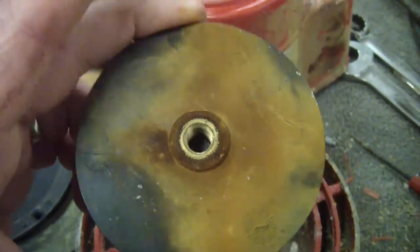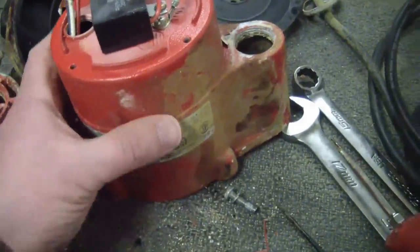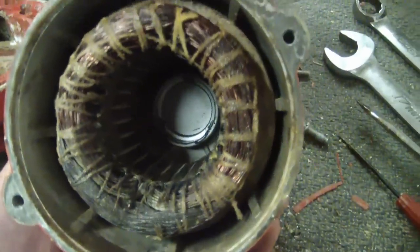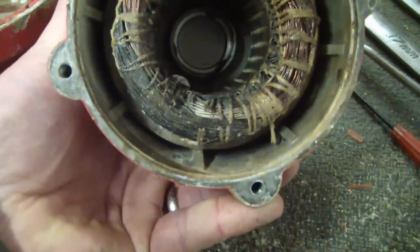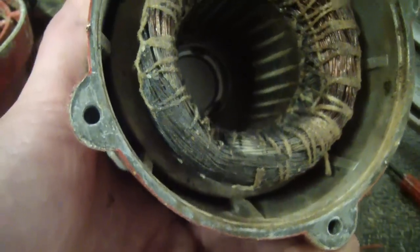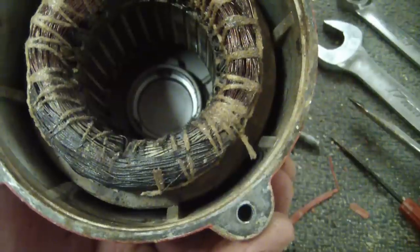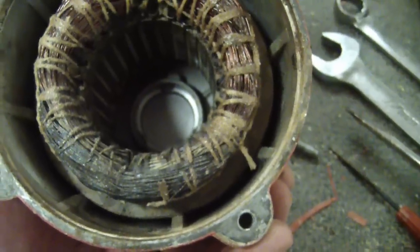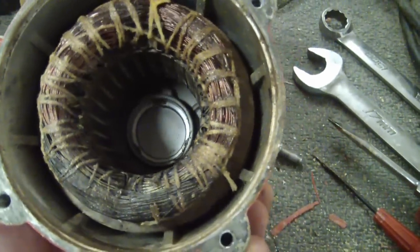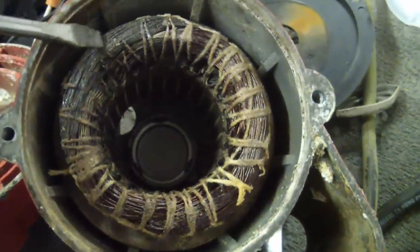Now have a look at all that rust — that's what they call foreshadowing. Once you get that impeller threaded off, you can have a look at the motor housing. Lo and behold, there was some water ingress. It corroded the windings — they got hot and burned off the motor winding varnish, that stuff that actually shrinks and hardens as it heats up then gets lacquered on. So clearly that was the trouble with the high-pot test — she just couldn't keep the electrons in.